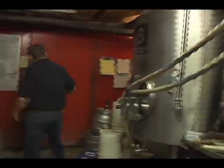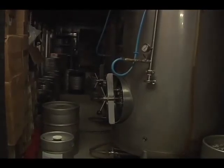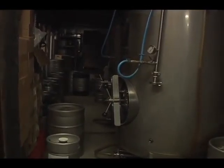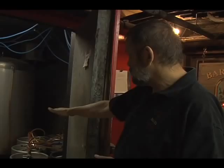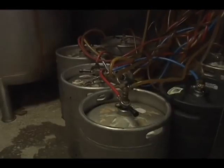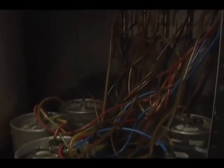The beer then goes in this direction — these are our serving tanks. These tanks go directly to the taps. The beer is pushed with nitrogen, which is very inert to the beer and doesn't make it foam. After the tank gets to a low level, where there might be just one or two kegs worth of beer left, we take that beer and put it into kegs so that we can put a new batch of beer in the serving tanks.